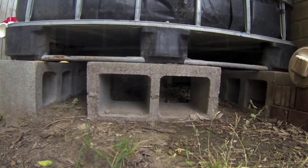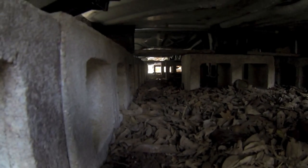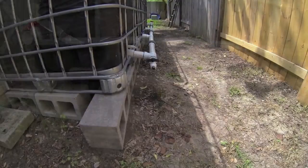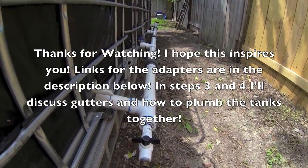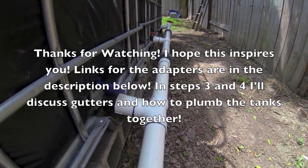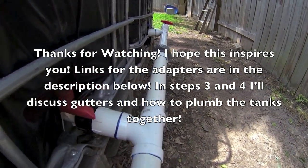When building your system, you have many things to consider when deciding what material to use. The most important thing I would urge you to consider for your foundation is the weight of your tank. Water is roughly eight pounds a gallon and that can add up quickly — each one of my tanks weighs around a ton. I wouldn't recommend setting them on dirt, as the cage could rust out quicker and they might also sink into the dirt making them unbalanced. Thanks for watching, and in the description below I'll have all the names and links to where I purchased these adapters.